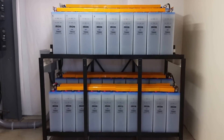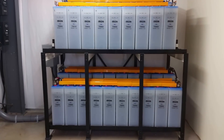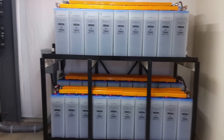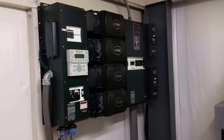Alright there YouTubers, this is a little overview of my off-grid battery upgrade that I just did for a customer. We just put an 800 amp hour bank of Iron Edisons in. We wound up running 38 batteries, dropped two because we're running Outback inverters — we had to drop two to keep the voltages where they needed to be.